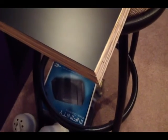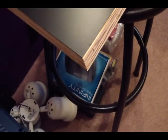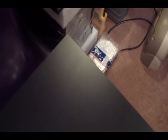It's very thin. But I was getting a little bit of a smell there, and it wasn't just the smell of the laminate being trimmed. I think it was actually going so fast that it was trying to burn it slightly, but it didn't hurt it at all. I just noticed that smell, and I'm like, yeah, I'll back off the speed next time. I don't think I need to go any higher than about 3 on this stuff. Could probably even go down to 2.5. But like I say, we're going to flip this over,